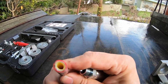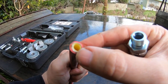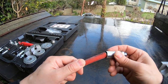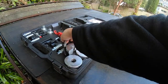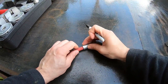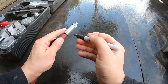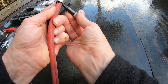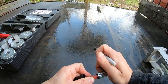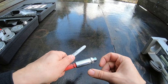So we've got a cleaned-off end — that's the hose that's been cut, and as you can see the different layers inside. Starting off with the quarter size, we get that in there, then take a pin and put some marks on it, so that when we zip it up we know we've got it properly done and haven't accidentally crimped it down there by mistake without it being fully homed.